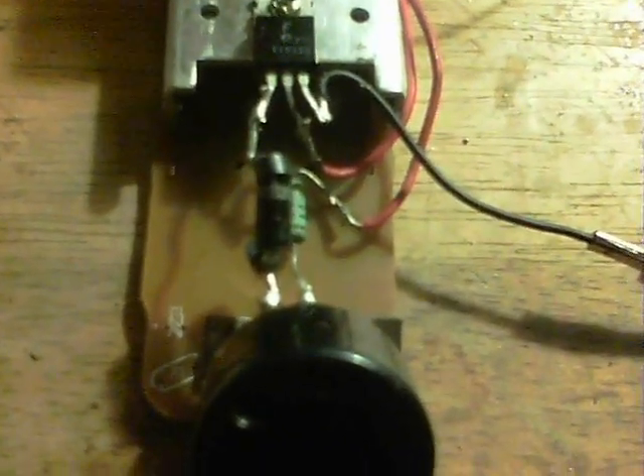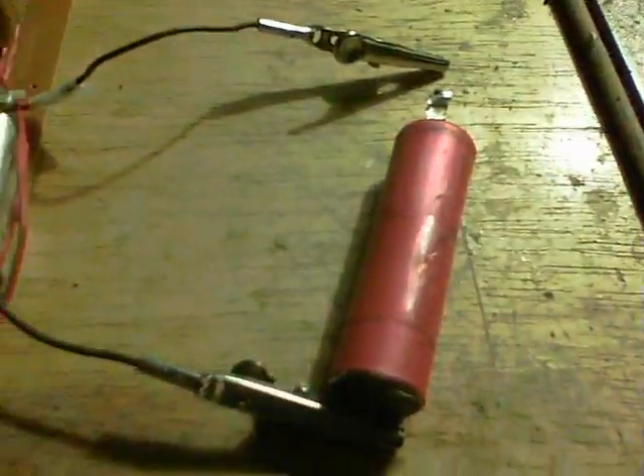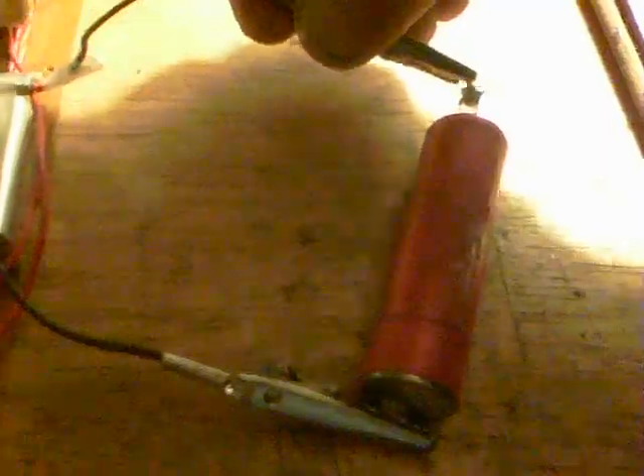I've got a TIP122 transistor and a 100-ohm big resistor there, which acts to stop these little pots from blowing up. I noticed the same sort of thing as Lidmotor had when his resistor was getting heated up and these little pots were as well — I was getting smoke out of them, but that cured that. I've also got a rather large diode there, but no capacitor on this circuit. Anyway, there's a 3.7 volt salvaged battery.